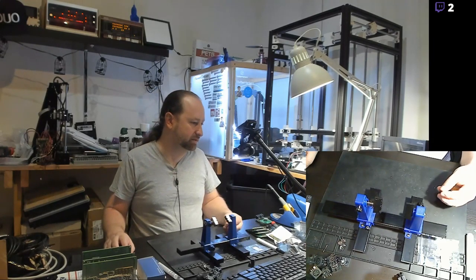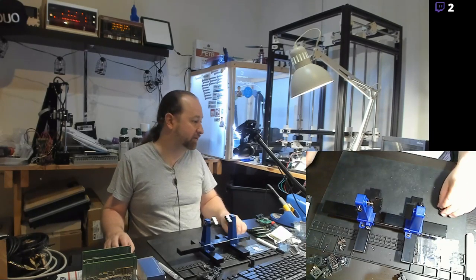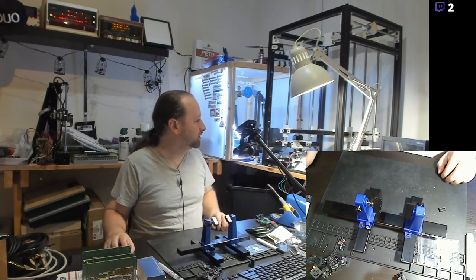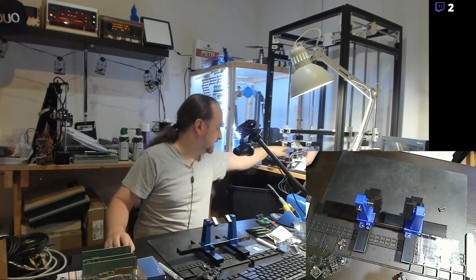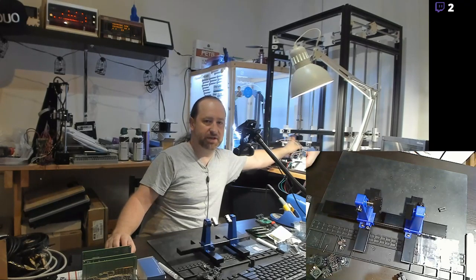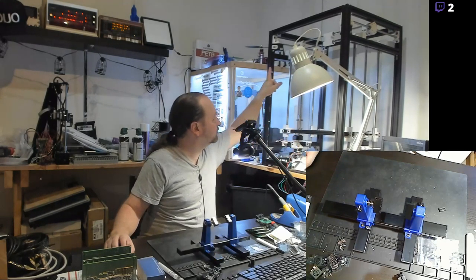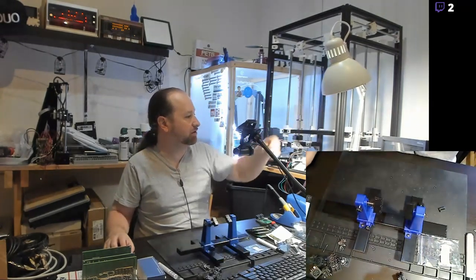And honestly, the original parts on that are just fine. I have a couple of modifications because I did some stuff like the ball screws. The ball screws were not originally part of the design. They used regular lead screws. And I had to custom make my own adapters to hold the mounts for the ball screw. And there's one on top I haven't installed yet. Kind of hard to see.